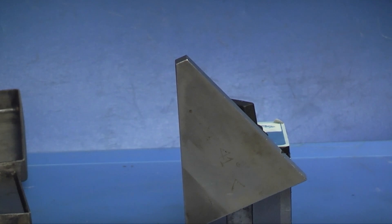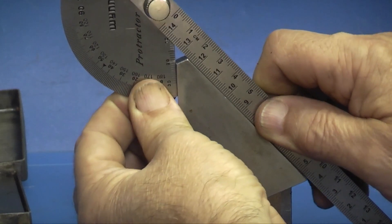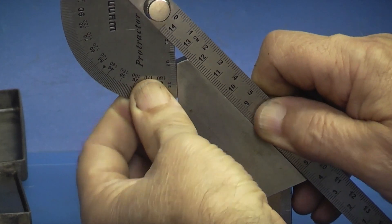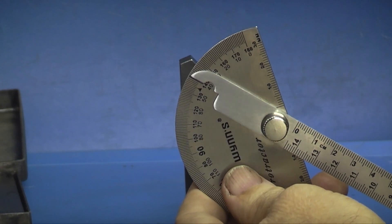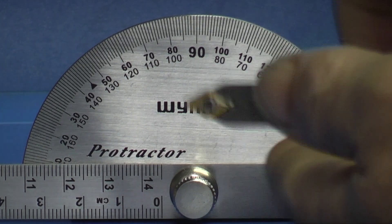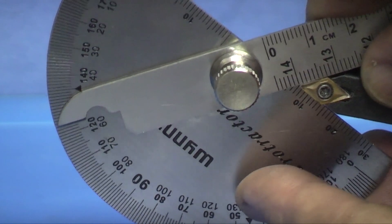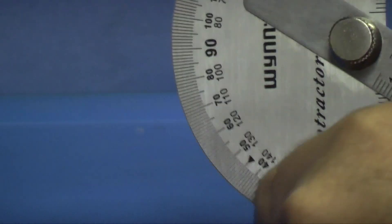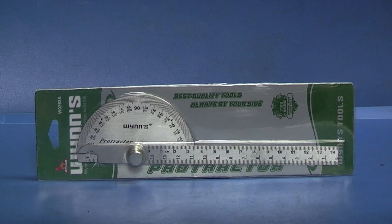I found this angle block — the angle on this block is 41 degrees. So if we put the protractor on, we can set it to the angle, move it round till it's level on each face and touching on both sides, then the angle can be read off the scale — and it says 41 degrees. If you wanted to measure the angle of this cutting tool, set it on each side, adjust to just the angle, and you can read it — it says 57 degrees. So nothing fancy, just a basic protractor with a clear scale.